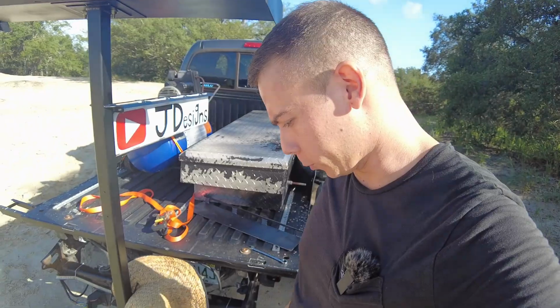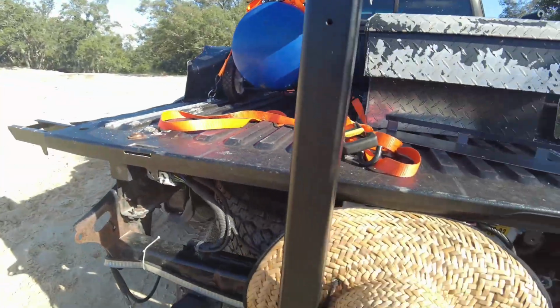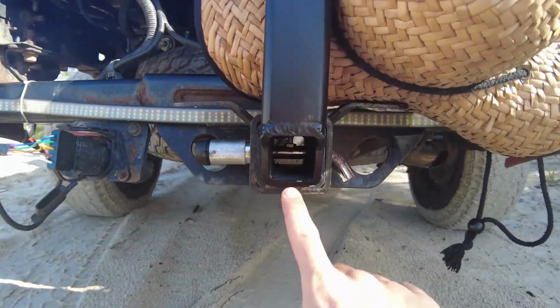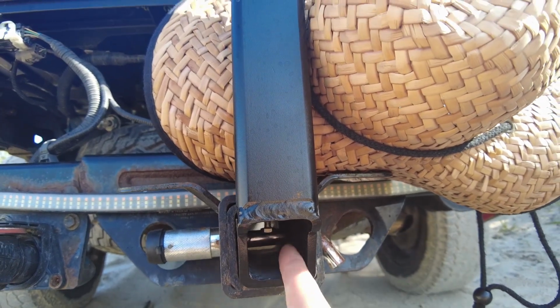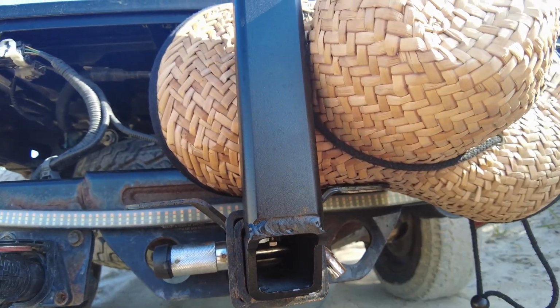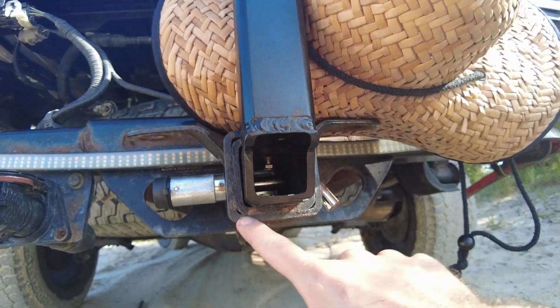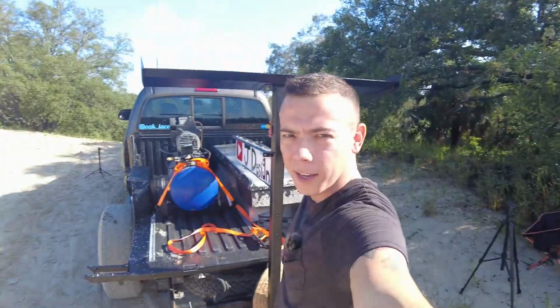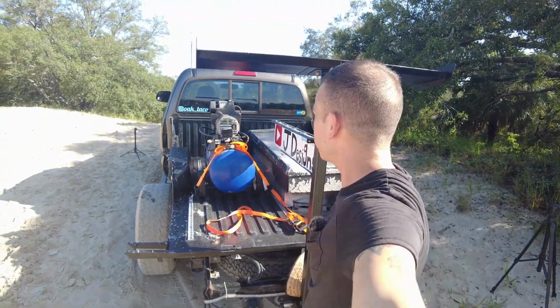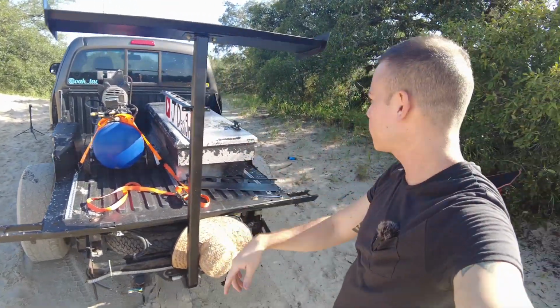And then I found a better solution. Right down here in the hitch, there's a little bolt in there. You probably can't see it. It's just a little quarter by 20 bolt, and that just pushes up on the hitch and consequently forces the wing down onto the bottom of the hitch receiver here, and it takes out pretty much all the rattle. I don't know if you can see it there or not, but I can shake the truck from the wing. It's decently strong.